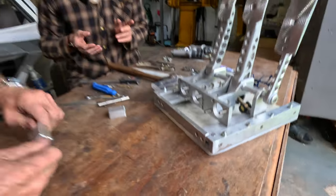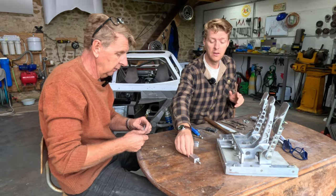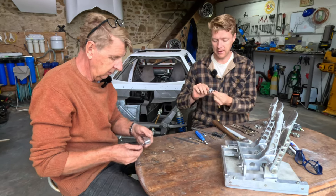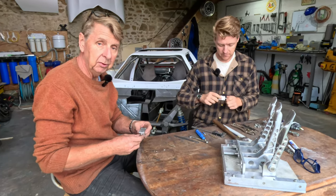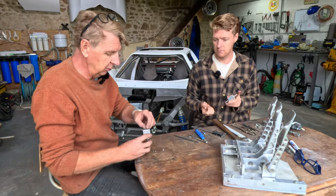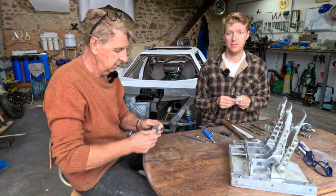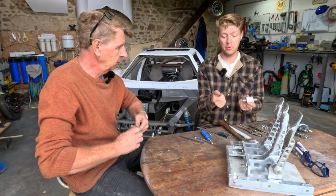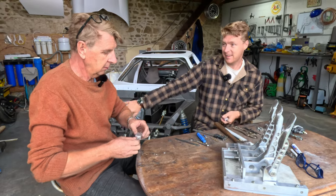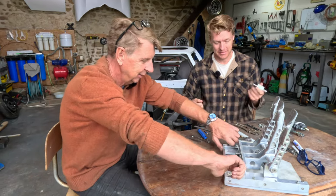It's a tricky thing because you want it to not jam, but you also want it to lock with absolutely no play or wiggle. So these bolts have to be really secure because you don't want anything that's all slack and baggy, do you? Nope. But we don't put it too tight either, so it actually all jams. If it's not perfectly lined up, it jams. So it's a delicate balance again with the tolerances, getting everything just as it should be. And we didn't want springs that are super heavy either, because you've got to compress two springs to unlock our pedal box, and you don't want your partner needing to be an arm wrestling champion in order to unlock the pedal box to slide it.